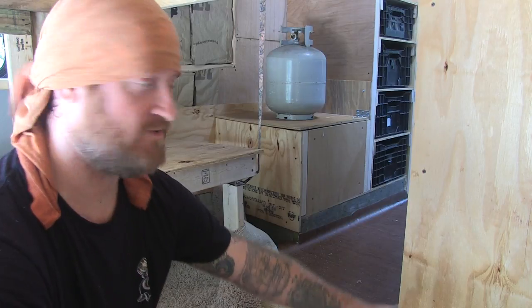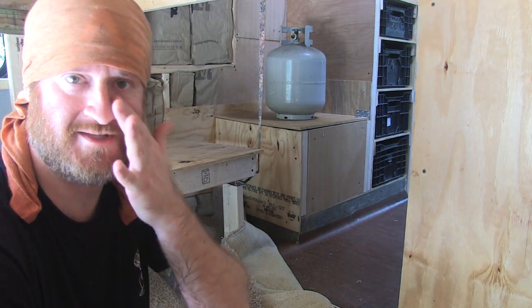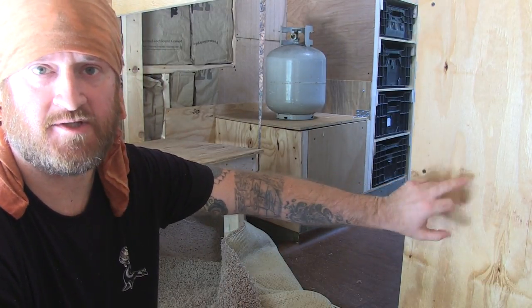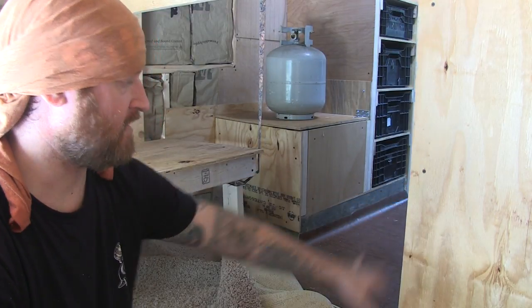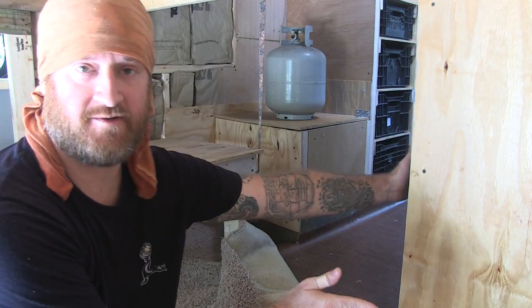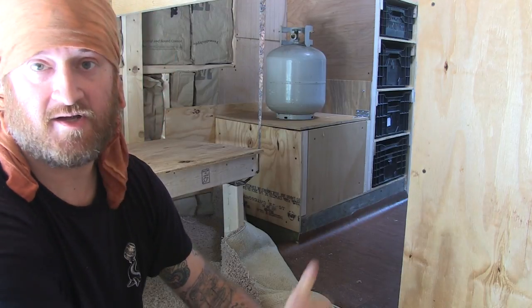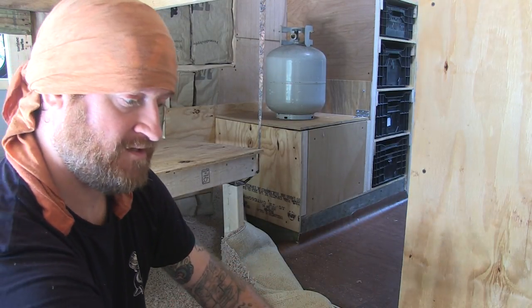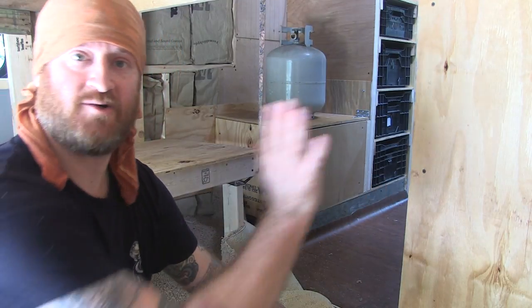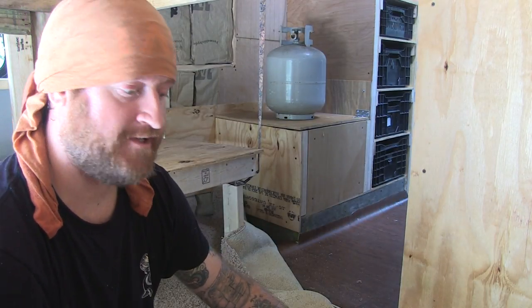In the case here, I'm actually going to build a 1.5 inch platform based on flat 2x4s and 2x6s to hold the basin for the shower, which is right on the other side of this wall. So I'm not going to use any of the area around the corner, so to speak. I'm just going to basically go straight. And obviously this corner along this wall here is going to be straight. So we're just going to cut a 45, and then I'm going to have to make another cut to fit that edge, and then obviously this one. But at least it'll wrap around and lay flat, so it will give me opportunities to do that.